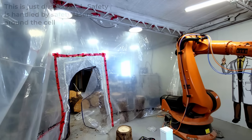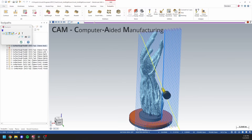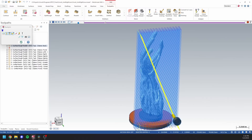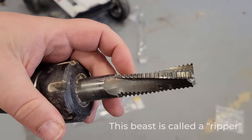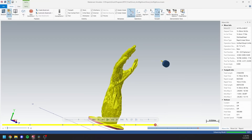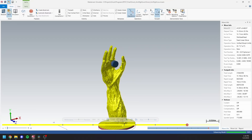When you're cutting a part on a CNC, you use a software called a CAM system. This lets you bring the part into software and program all the paths that the tool has to follow to remove material and leave you with your part in the end. Our roughing toolpath will use a large flat mill to remove as much material as possible really quickly, but that won't give us a surface finish that really looks close to our part, so for the finishing pass we're going to go through really tightly with a very small bit.